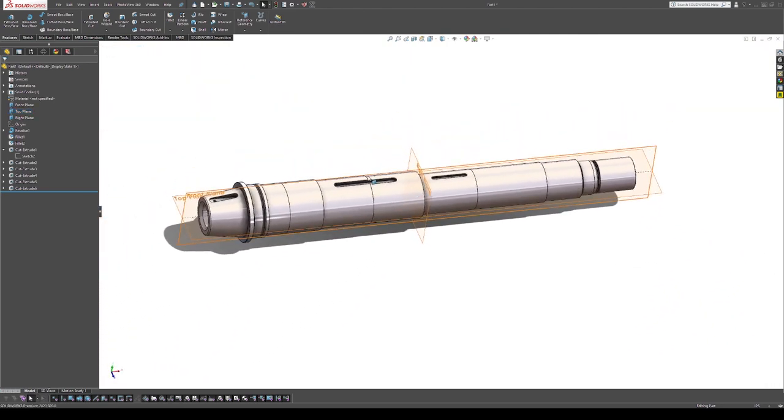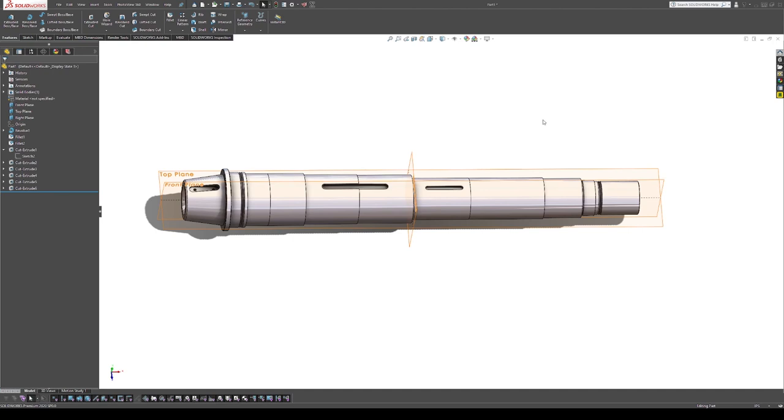This covers all of the actual modeled features. When this is turned into a drawing, I would note the dimensions of all the threaded features. For the sake of not bogging down the modeling, I don't include the actual threaded profiles in the 3D model most of the time — it just takes up a lot of space.